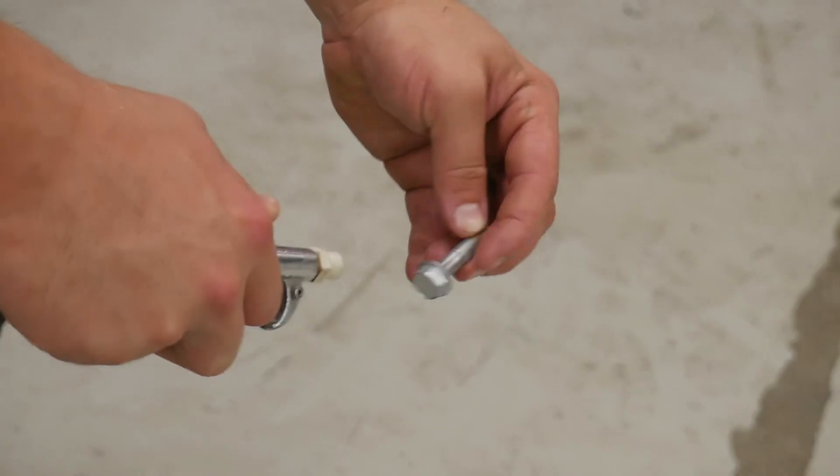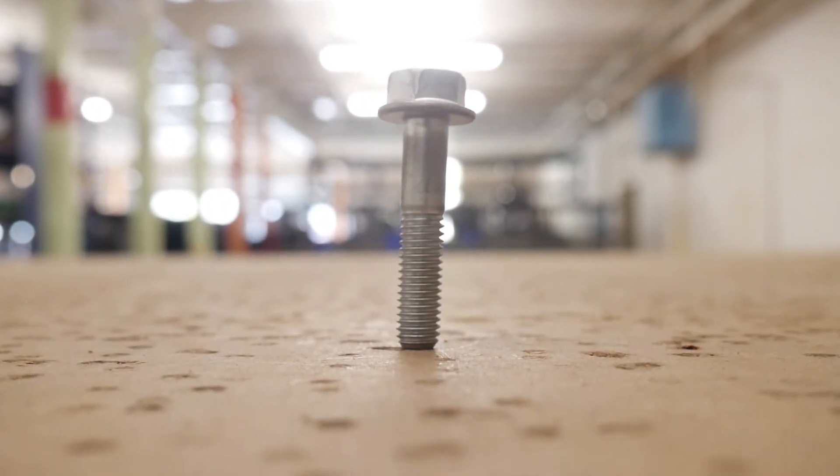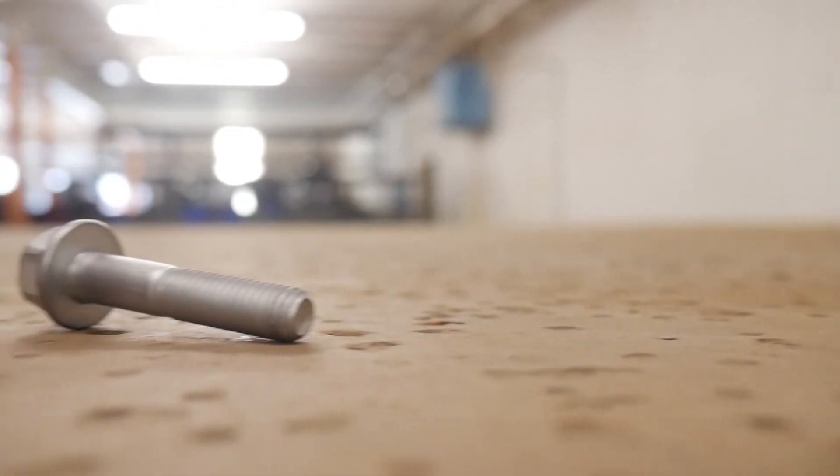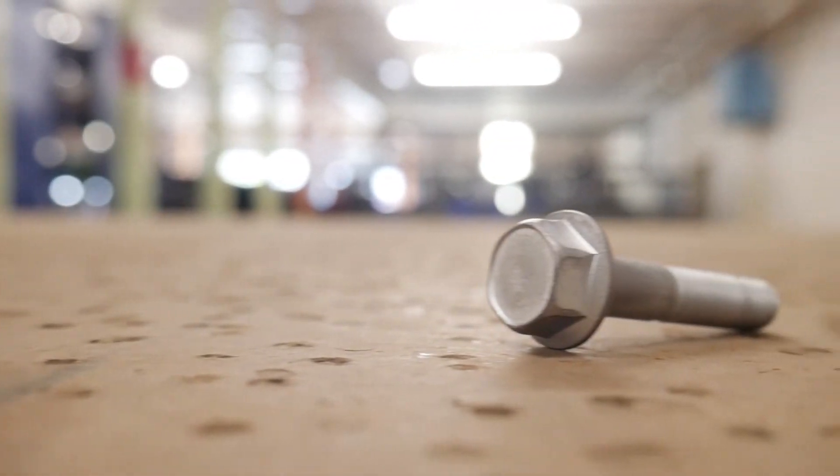Back after blasting — literally seconds. You can see how fast it removed the coating. This bolt is ready for replating. It puts a very consistent, smooth finish on the bolt, and you're not actually removing or damaging the threads, which is another key feature. We removed the zinc plating in literally 10 seconds, and this is what you're left with — ready to replate.